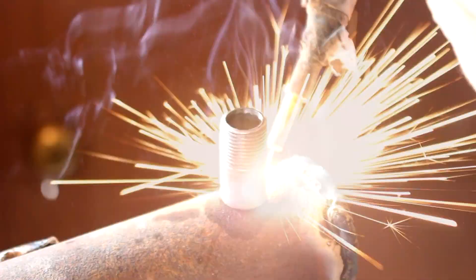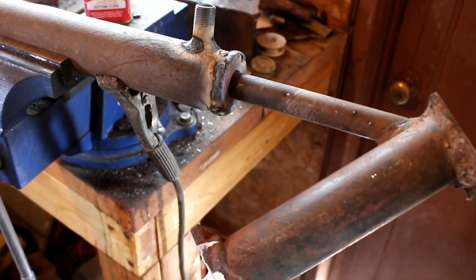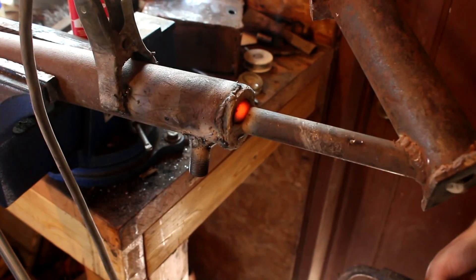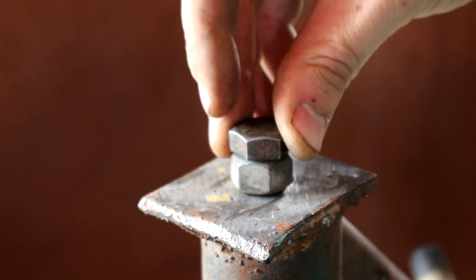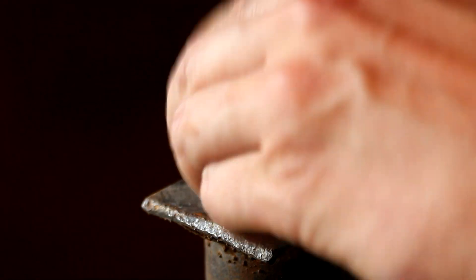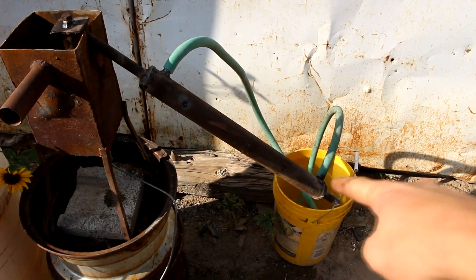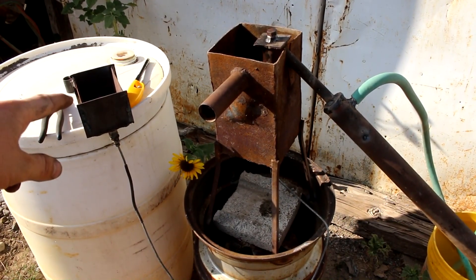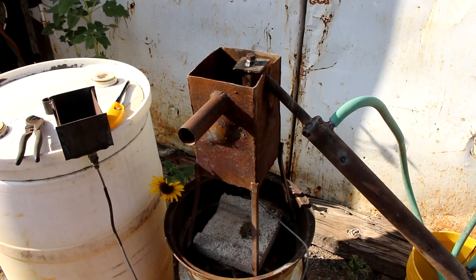There's one. So here it is — I've shoved it through the condenser. I'm going to weld right there. Okay. The final thing I'm welding on this is a nut right there so I can take the bolt out — that way I can add something or take something out. Let's weld it on. So here it is all finished. You can see the water jacket there. There's a pump in the bucket to pump water around. That's my reservoir where I'll put stuff in for it to flow in to get boiled. And I've got some charcoal briquettes in there. Let's light it up — just like that.